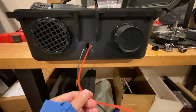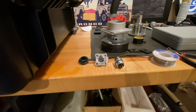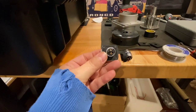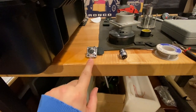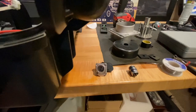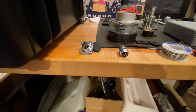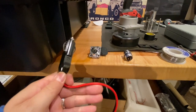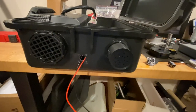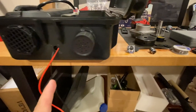We're about ready to go ahead and solder up the leads to the switch right here. This is the switch that goes on the plug side that's going to run to the EcoFlow. This is the plug that runs to the diesel heater. On the back side of these plugs, they're labeled one and two, so I'm going to make sure that whatever I put in slot number two here is the same on this side. I purchased one of these kits with a cigarette lighter plug on this side — that's going to go to the EcoFlow — and then I'm just going to cut off the end and solder this lead into this one. Make sure that before you start soldering, you run the wires through the hole, because once you solder this to this pin you won't be able to fish the wires back through.